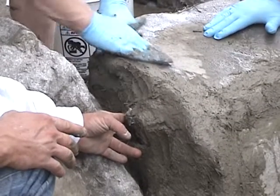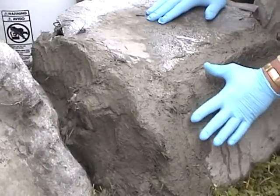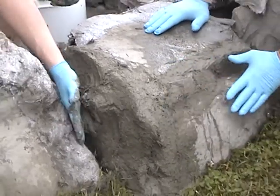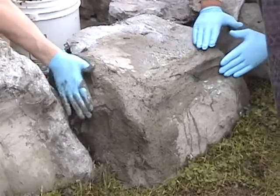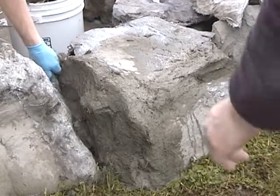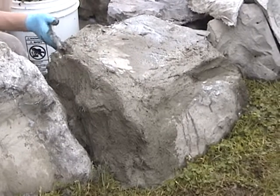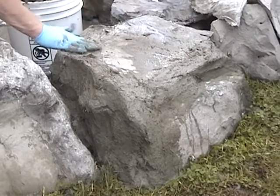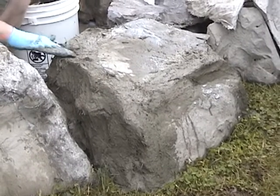Watch what I'm gonna do here — see this elevation change? I'm just gonna feather that in a little, just gonna touch it up. Now if you want a nice 90° edge — you know how you get that crisp edge — to reduce the amount of grinding, take one-mil plastic or shrink wrap, lay it over here, work out the air bubbles — it's smooth. With this rough rock and texture mud you wouldn't have to grind this if you didn't want to. You can just put the texture mud right over it. We're trying to show you the different aspects of procedure.